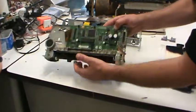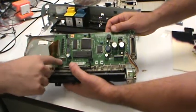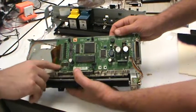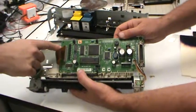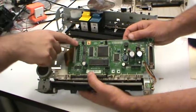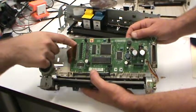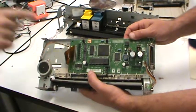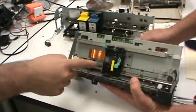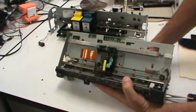The microprocessor can't put out enough power to drive that motor directly, so you have to have something. Probably this chip is the drive chip. When we were following the traces on the board, all of the paths from this chip either go to the motor itself or back toward the chip — it does not touch this ribbon cable. These transistors here touch the ribbon cable along with these two controllers, and this ribbon cable then controls the inkjet itself.